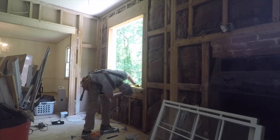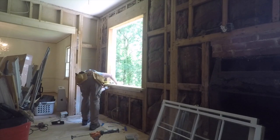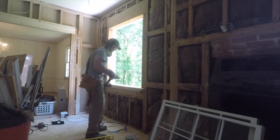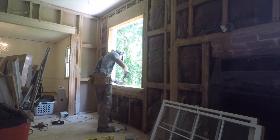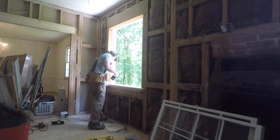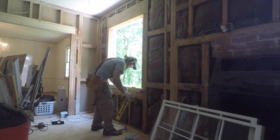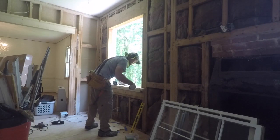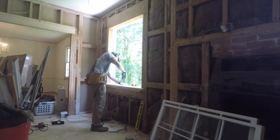The alternative is that at exactly where the edge of the window ends, you can bevel that and get your water runoff that way too. Now I'm just going to use some 3-inch deck screws and secure that. I'll go back and check the level one more time once I'm done. I'm checking the distance between the inner dog ear to make sure I have at least half an inch — it's about five-eighths inch now — gap, so I can slide drywall behind it.